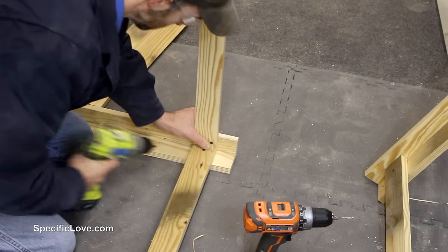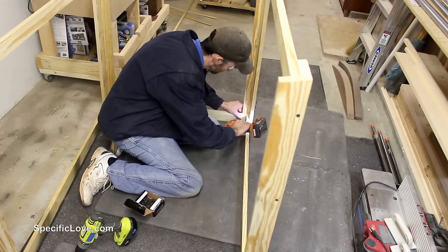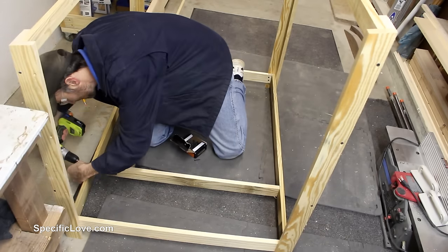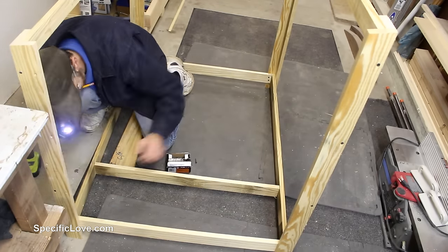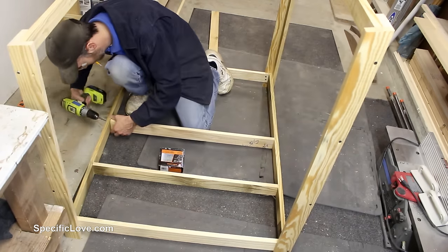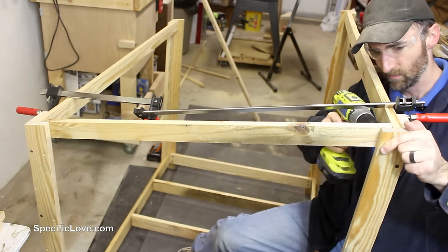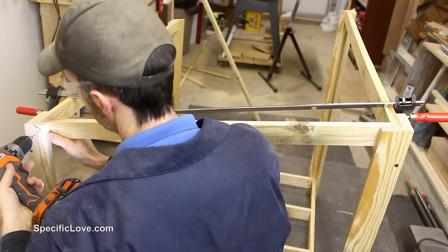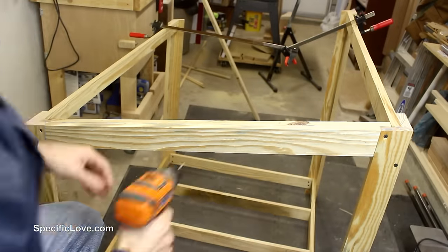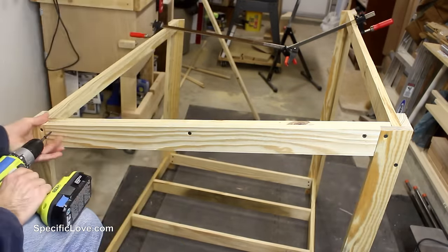At this point I had to move all of the pieces to the floor for more room. I then attached the two remaining base frame supports to each side, and the structure started to finally look like a doghouse. I next measured out the appropriate distance for three more floor joists to help support the plywood I plan on using for the floor, which also gave a lot more strength to the total structure. Moving to the top of the frame, I had to add two more joining supports which also had to have a 10 degree cut on each side for the appropriate pitch of the roof. I also added a secondary piece which will help box off the outside frame of the house and provide a small lip for the inner walls to lean against.